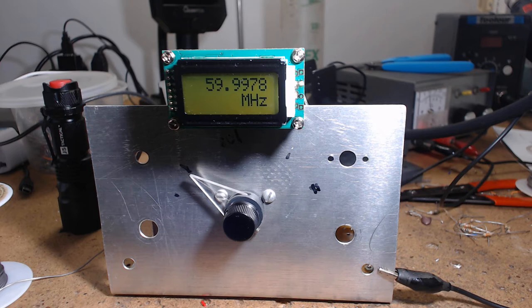If you watch that last digit on the frequency counter you can see a change between eight and nine. The frequency counter has a crystal oscillator in it, and I have this frequency counter connected down to the 60 MHz reference for the huff-and-puff. I just wanted to see if the digit was bobbling on the end. Some of the bobbling I saw is about 100 Hz.